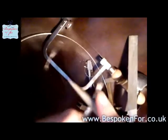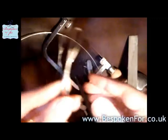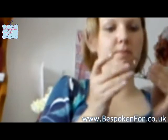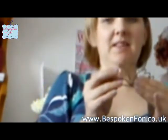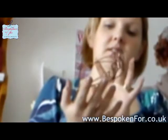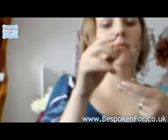White is the actual colour of the silver. Then once I've got it back in I can polish it. I'm going to continue here with the filing so you can see what I'm doing, and I'll show you my next step very soon. I just want to show you how far I'm getting — the frame is now completed and I've completed most of the soldering. There's still a few bits to go. The piece is absolutely covered in black tarnish from the flame, but it's going to look fantastic when it's ready. My next step is to pop it in the pickle and remove all this black.